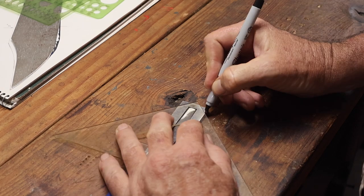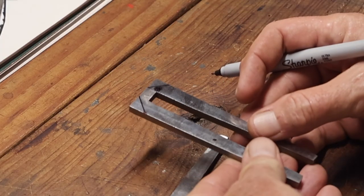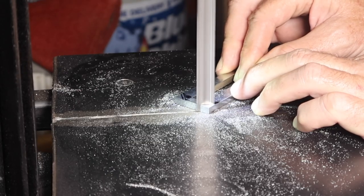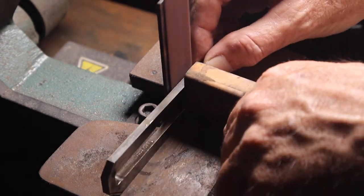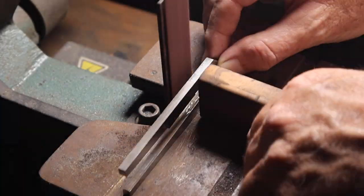After that was done, I marked out where I wanted to cut the corners on the very butt of the handle, went back over to the bandsaw to cut those out, and then to the grinder and belt sander to clean up those edges. I also took a little of the thickness off so I could match the thickness of the tang.